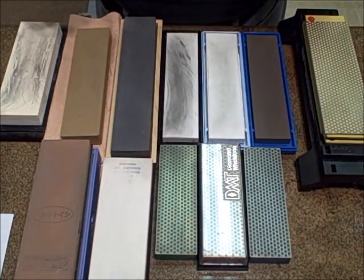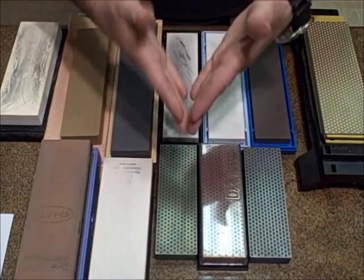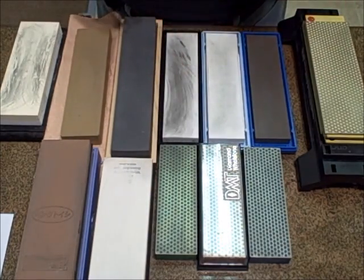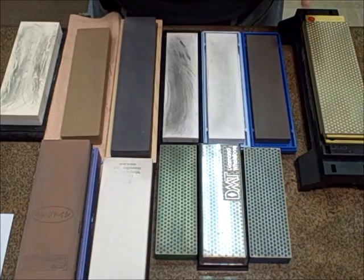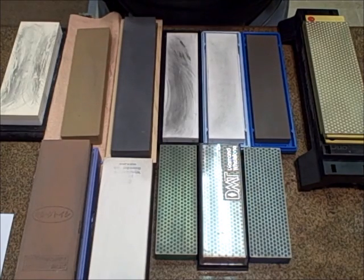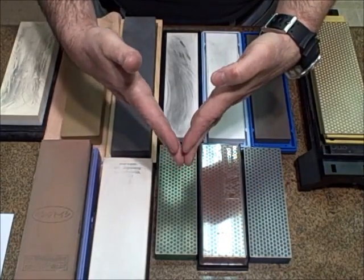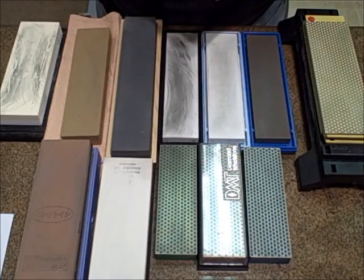So we're going to be talking about a standard French knife. We'll get into the Japanese knives later. Say you have a 50-50 grind at any angle, 40 inclusive, 20 on each side, or 50 inclusive, 25 on each side. The way you get there is to create a burr. It's two separate planes, one plane, two plane, to create your primary cutting edge.